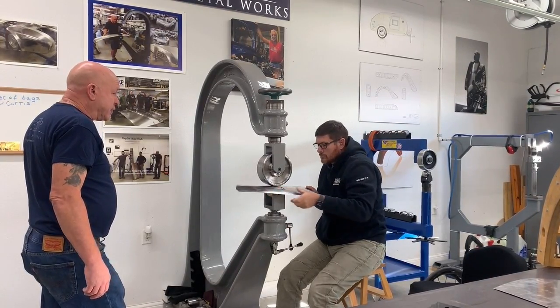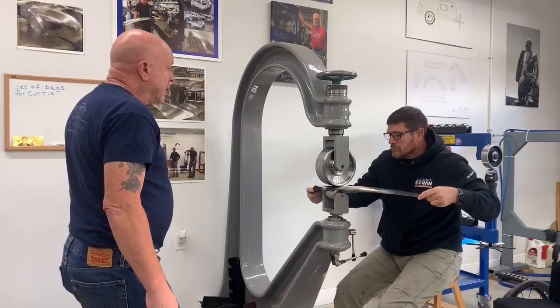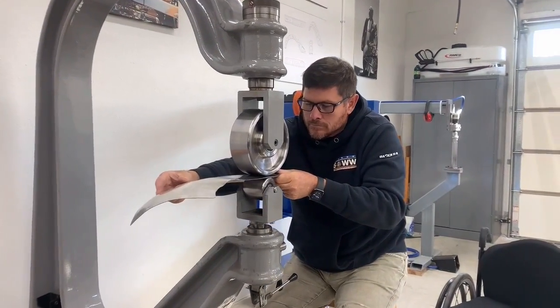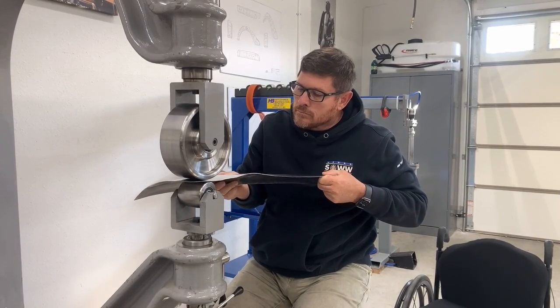It's just preference, working with the panel on the inside of the wheel or working with the panel on the outside of the wheel. But you get comfortable by spinning the panel. You'll get comfortable both ways. So definitely don't wheel right on the edge, but you can wheel up to the edge.